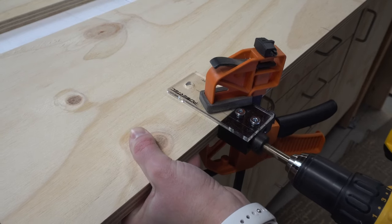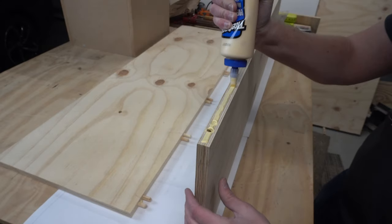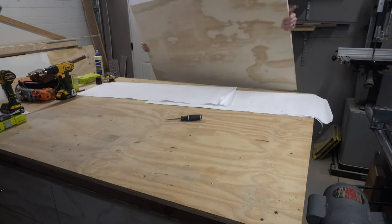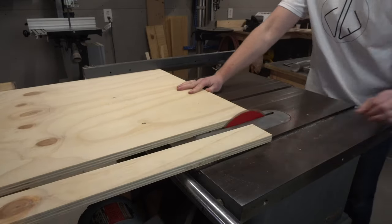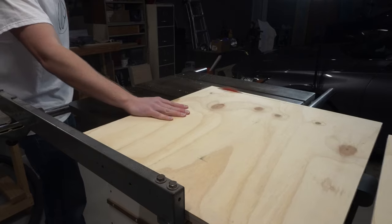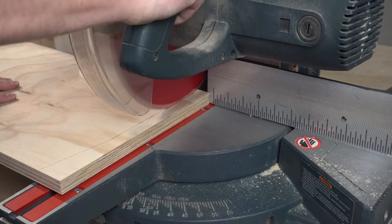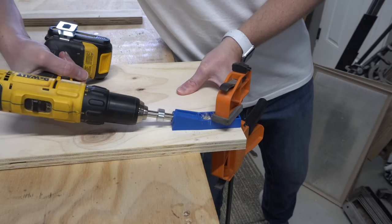For this next addition, I needed some plywood pieces that were slightly bigger than the scraps I had on hand. I really didn't want to cut into a fresh sheet of plywood, so instead I used some dowels to join two smaller pieces together. Then I took that piece of plywood to the table saw to cut out the two side pieces for the large dust hood. Then I cut the top and a stretcher piece out of plywood and added some pocket holes to connect everything together.